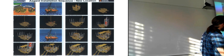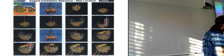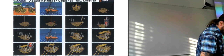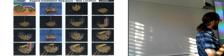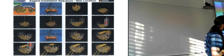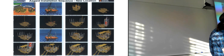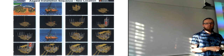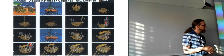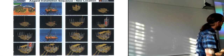And then they move along from well to well. They drill their wells with the BOPs on top. Once they've done that with all the wells, they put on caps just to seal them off. And then they deploy the manifold. So the manifold is still waiting on top of the vessel. They put the manifold down into the center there. I'm guessing that there might be collisions between manifold and blowout preventer, so that's why they haven't put the manifold down before they put the blowout preventer and drill the holes. I don't know the exact reason why, but that's just my guess here, why they are doing it in this exact sequence.